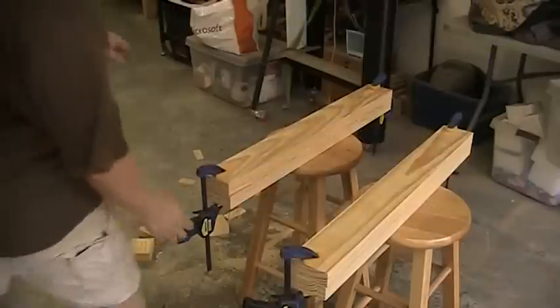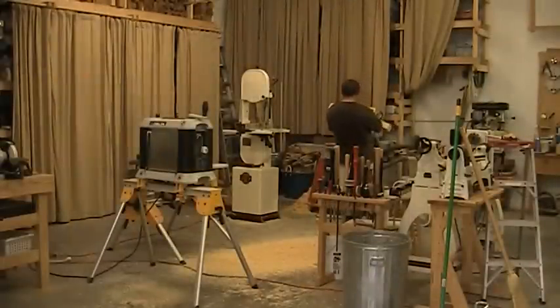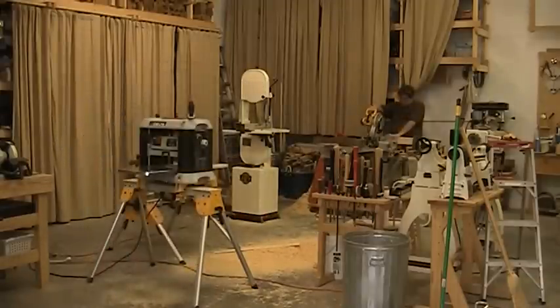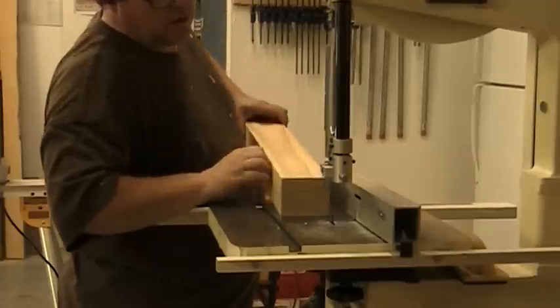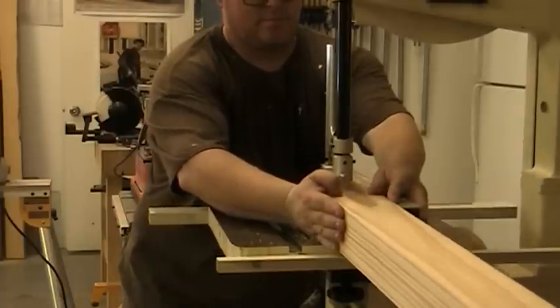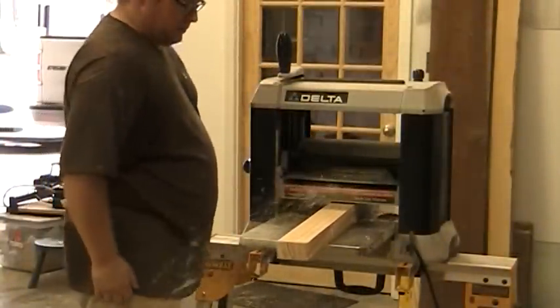So it's lunch time. We've got all the milling done and the legs glued up. Back to the legs to dimension them up - remember I only flattened the interiors that glued together. Just like on the stretchers, we start at the jointer to flatten one edge, use it as a reference against the fence to create the adjacent side at a perfect 90 degrees, finish to the bandsaw to get the dimensions I want, and the thickness planer to get parallel sides. Because I only have two legs and I need four, I needed to bisect them - I just go to the bandsaw and move the fence until I can get the saw blade into the same kerf when I flip it along the horizontal axis. Then back to the thickness planer to remove the bandsaw marks.